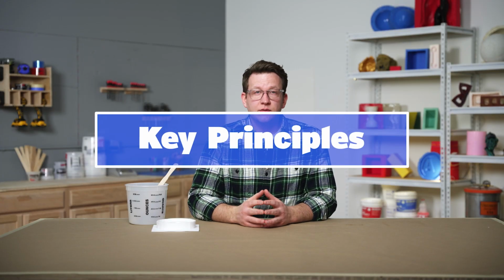There's a lot to consider when we mix and pour our silicone. In fact, there's just too much to cover here in this course. For a more comprehensive look at this process, we can jump back to that section in our Mold Making Basics course. However, let's review a couple key principles briefly before moving on. First, it's important that we properly measure our material. Silicones can be measured in different ratios in different ways. That can be 10:1, 1:1, or even 100:85 by weight or volume. Make sure to read the instructions for your specific material.